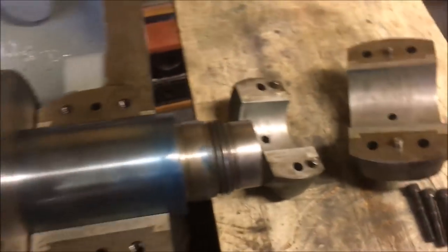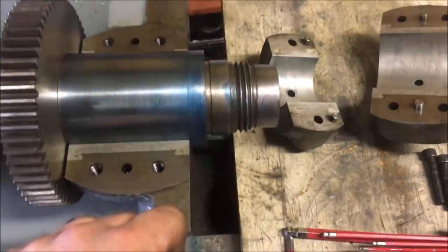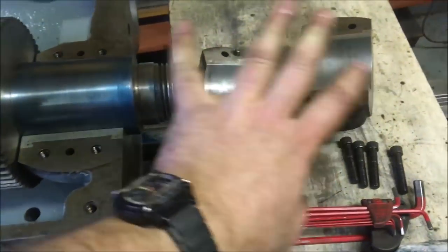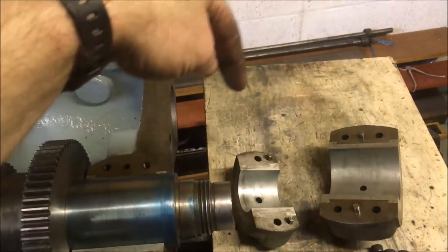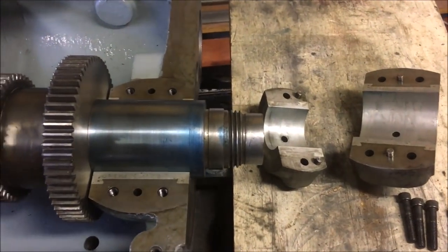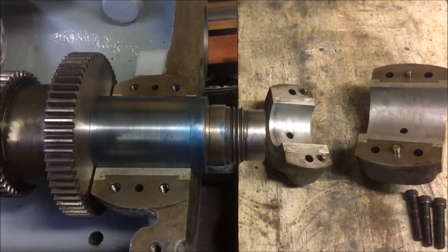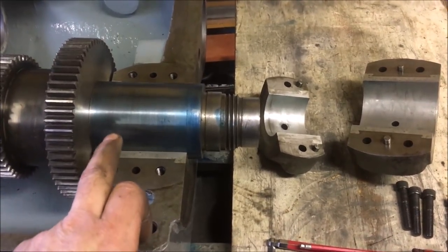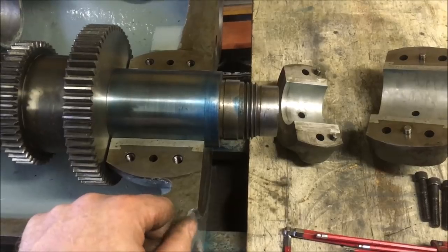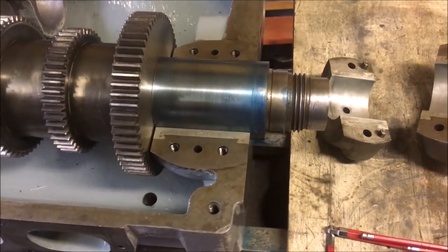So somehow I've got to try and measure the lift that I can get with the bearing block clamped down. Now, bearing in mind when we first looked at the lathe with the chuck on, and the DTI sat from the bed to the top of the chuck and a piece of wood under the chuck, levered down, I think we've got 35 thou lift, which I was a bit gutted about. However, I'm also of the mind that somebody had been in, and I can't recall whether these bearing top caps were clamped down tightly, so it may be that the 35 thou was mostly just taking up the slack. Anyway, so I've got to come up with a rig to do that now.